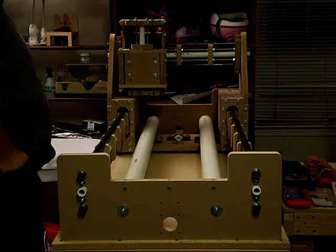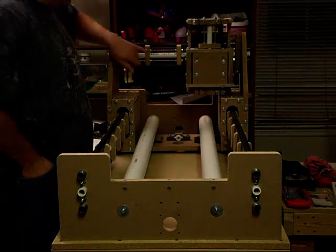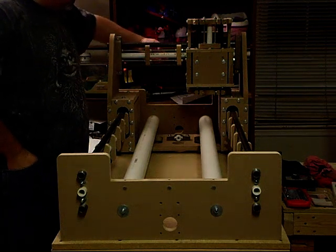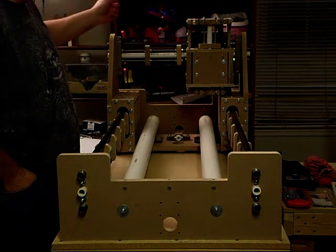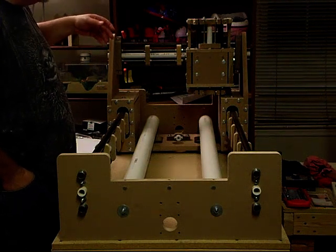The design is very similar. We are still using half-inch gas pipes supported by spacers to basically keep it from compressing. I did go ahead and add the threaded rod to kind of secure everything up and put it in position. This was optional on the previous machine, but I decided to go ahead and actually do it on this machine. It actually came out pretty well.